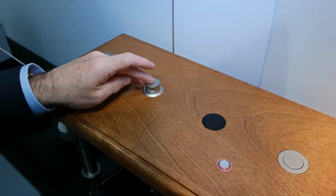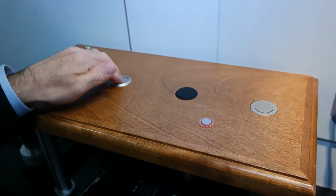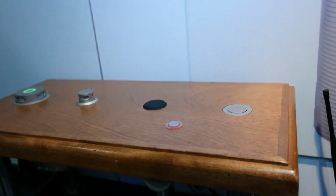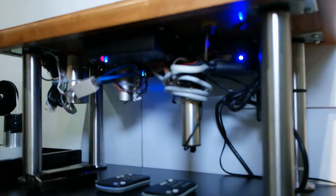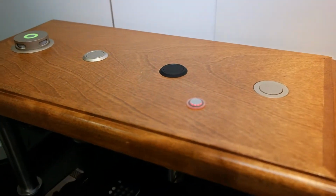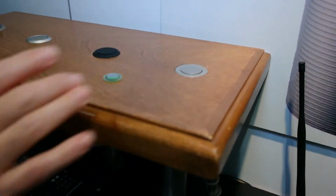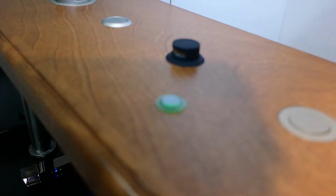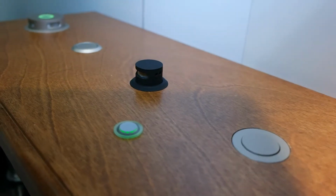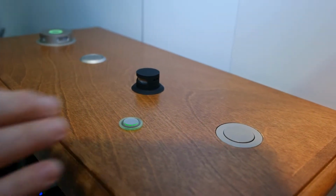Of course, here we have our standard CRM 102, which is a cardioid, again, that disappears once you press on it. You also have a latching mechanism in there and a magnetic reed switch to give you a contact closure, so that at the end of your session, you want to make sure that all your audio is muted, so then you get your contact closure and all the audio is gone. This is the ARM 102, the same as the CRM 102, but the motorized version. And it works exactly on the same principle as the CCRM 4000. So again, one home run back to your DSP, and you can bring them all up and down.